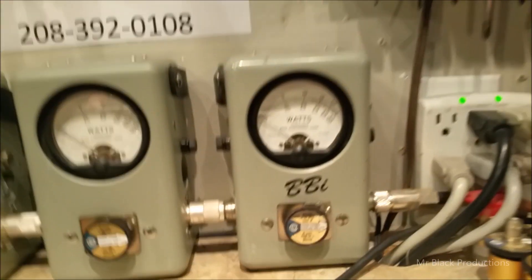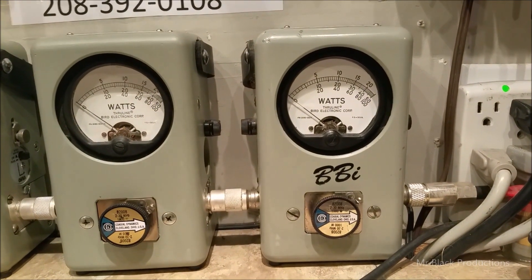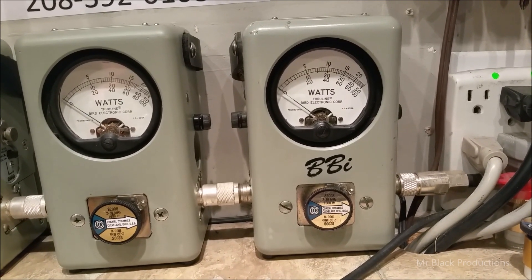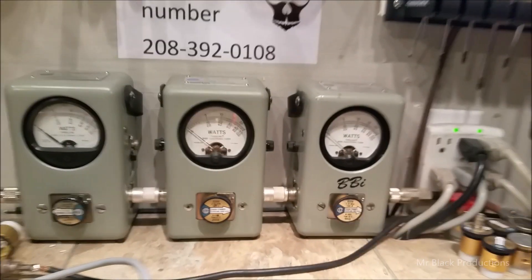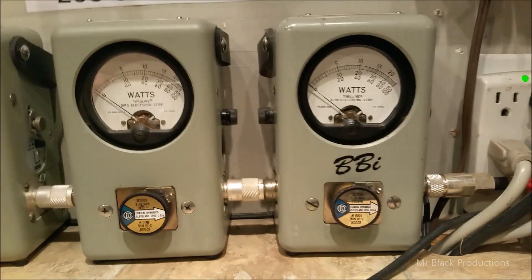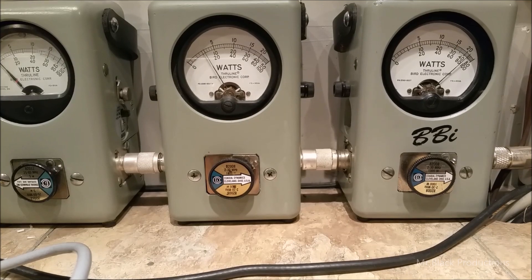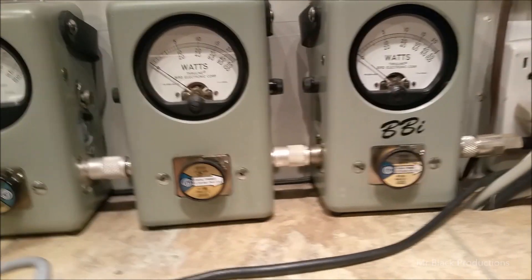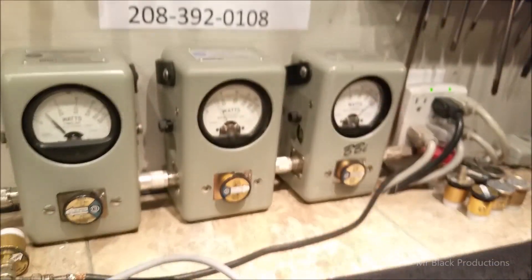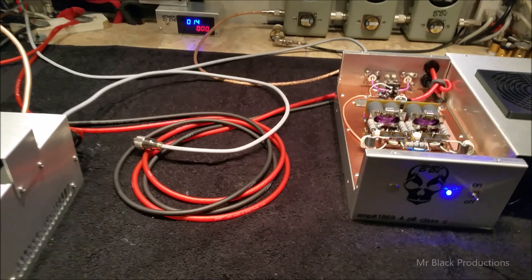Everything's off. I'm going to demonstrate the Stryker for drive, so we all know we're going to put about 100 peak watts in this thing. We're about 98 watts, 90 watts — somewhere in our peak. Talking through it, no loss. Take the amp on — it's about 900, 910 watts peak. Half a watt of reflect, 100 going in. We'll switch over to the Connex.